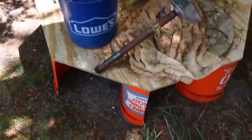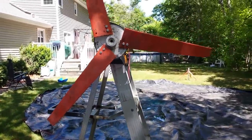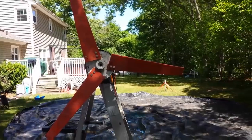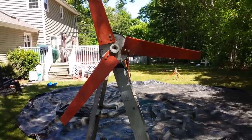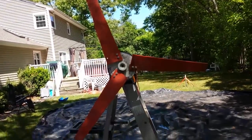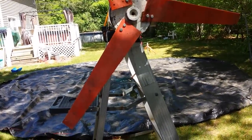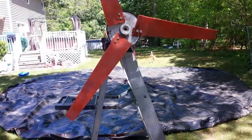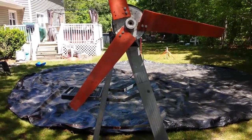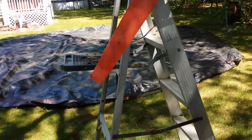I had cut halves from these buckets for another project but they never worked. So I looked up HDPE recycling, which is the type of plastic — apparently you need to have a number two in the recycling symbol. I read that you can melt it down, and that's exactly what I did. I melted the halves down, cut them into little pieces, melted them down — they got a liquidy consistency — and then it came out like a flat plate of plastic, and I simply cut the blades out.